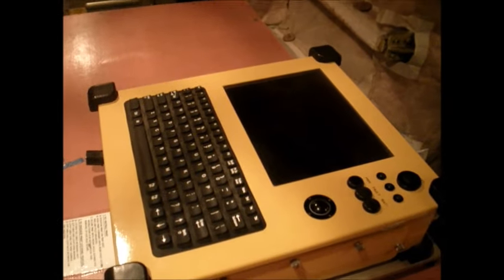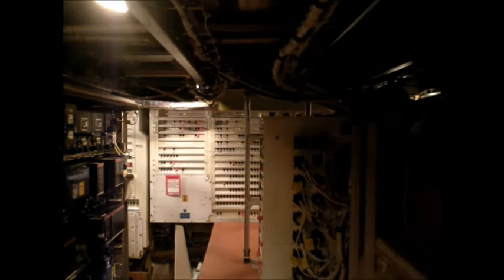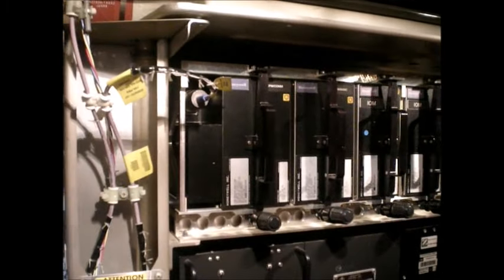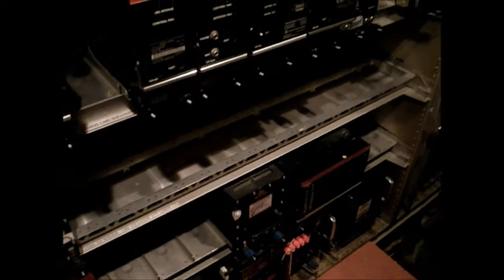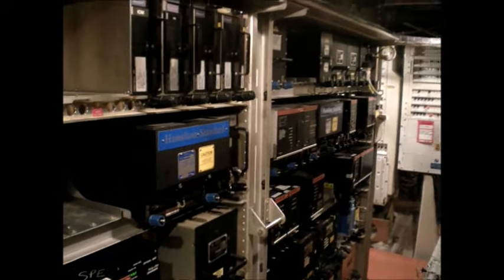This is one of the computers I use to troubleshoot the airplane. It's connected to the data bus, which talks to all the systems. These are electronic racks. They're separated electronically as well as physically — some are on the right and another system does the same thing on the left, so that if one side gets damaged the other side will still be functioning. They each have their own electrical system as well as physical separation, so an accident or a fire most probably won't take out everything all at once. Usually we have a left, right, and center system that does the same thing.